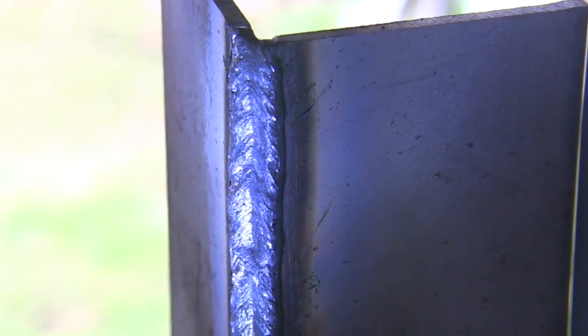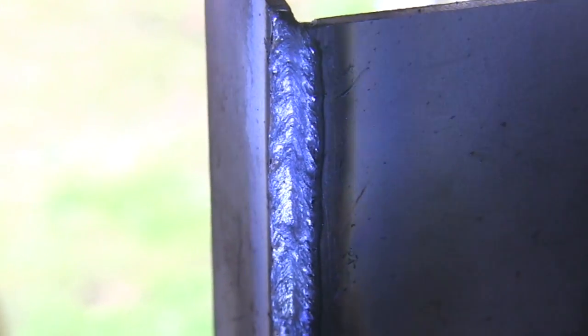Today I'm just going to be using a 6011 for doing regular joints like lap joints, T-joints, and outside corner joints. At times I'm going to have it set just a little cold because it's a one-eighth rod and I'll be welding on things like this outside corner joint. I want to be able to weld downhill on an outside corner with just one-eighth wall — it doesn't make sense to go uphill, and I can go downhill and get really good penetration with a 6011 at about 110 to 120 amps.